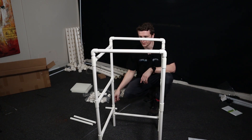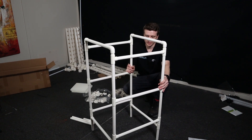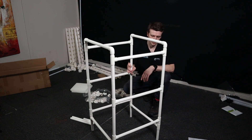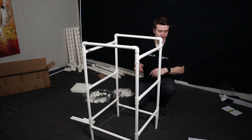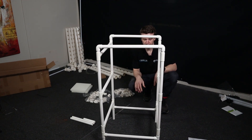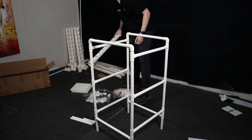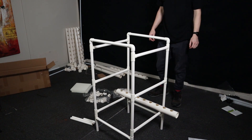This is the frame. I've got a few little bits left over which we'll probably use later but this is the gist of it. If you really wanted to make this more rigid I'd recommend using some solvents and glue, but piece it together first, then pull it apart and do it in sections to make sure you've got it right. Always make sure things are as straight as you can. We're going to move on to piecing together the actual troughs — as you can see we've got three layers here and they'll just lay in the base like so.